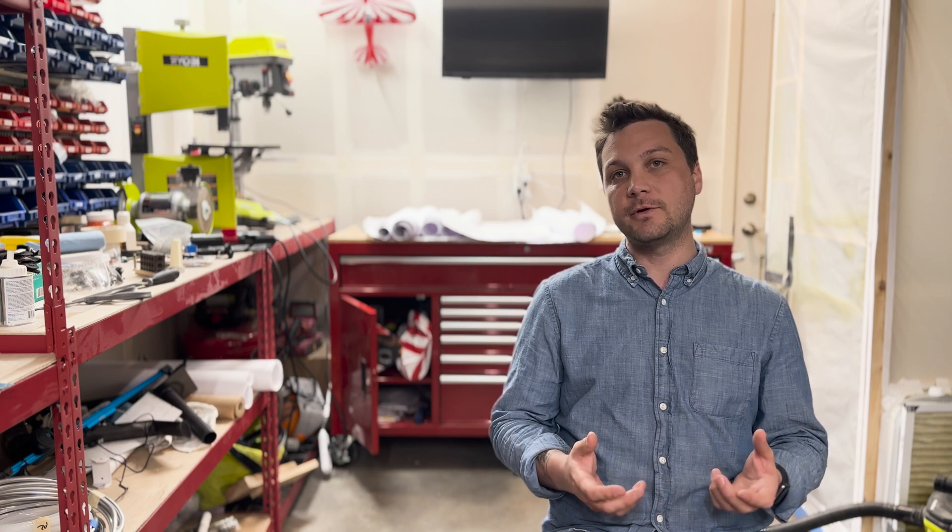For those who haven't seen this, in the last few years Vans has seen unprecedented demand in kits. After some careful consideration, they selected subcontractors to help form some parts. Vans mostly uses punches and forming machines to create parts; the organization they contracted with utilized a laser cutter. What builders are finding is a propensity for dimpled holes to crack. The laser cutting is simply not as clean as it should be, and the jagged cuts create the starts of tiny little tears in the metal — exactly what builders are actively trying to avoid through stages like deburring.